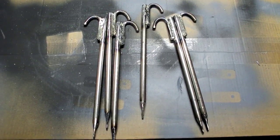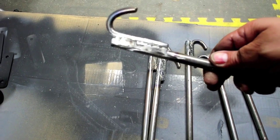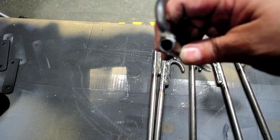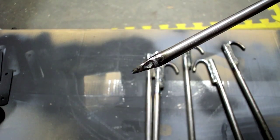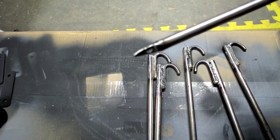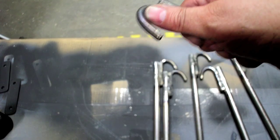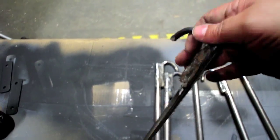I had enough material, so I just made 6 of them. If you look at one of them, this isn't the best welding job of course, but I'm learning. This is where the rope would go around the guy wire, and there's a hole in the end here for the whirligig. I cut a slot in here with a jigsaw, then pounded the end down, welded it, and ground it down to a kind of a tip. These are one foot. I've still got a few little burrs on here that I want to get off so it doesn't snag a guy line.